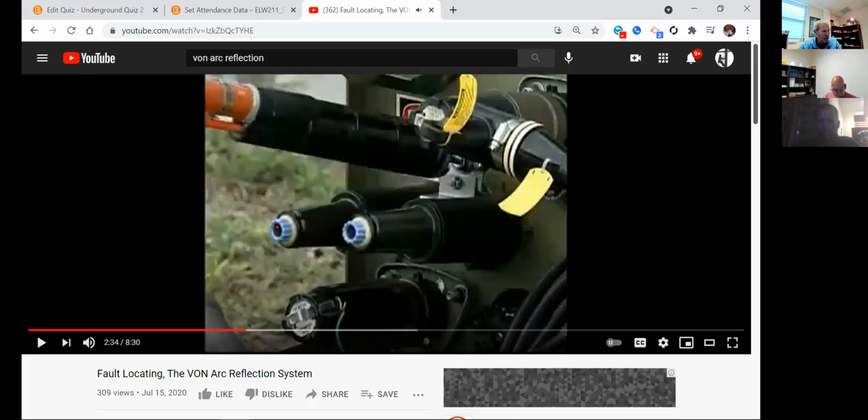Now he's got a feed-through device. I'm going to put one elbow on one side and then have an open port here. I don't know which one he's going to put it on. Then I'll have an open port here to put my test probe in. Right behind in this area right through here, there's actually just a metal bar. It's insulated, but there's a metal bar inside that feeds through from one side to the other. That's why they call it a feed-through insert.